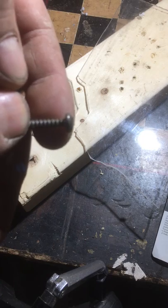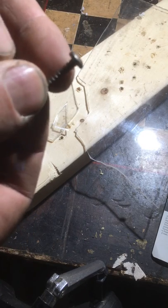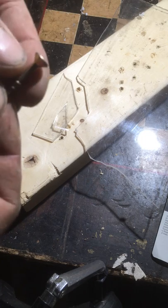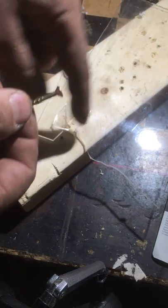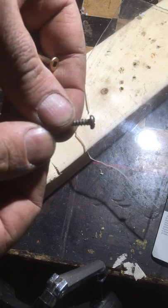That's why you want to use a pan head style or flat bottom screw, because then it's going to sit flush and push flush as it goes in. The countersunk shape tends to want to shatter and blow out the plastic. That's why you want to use this shape.